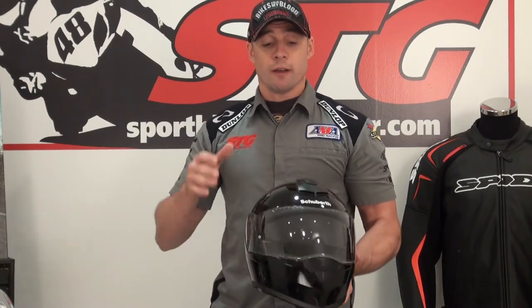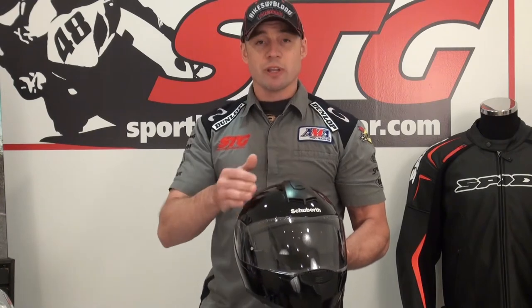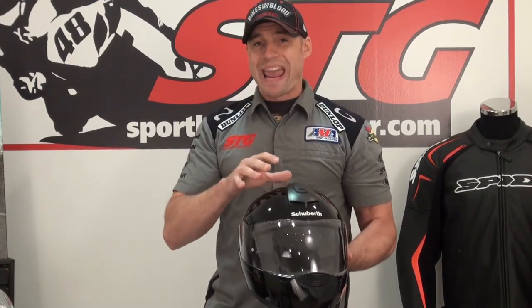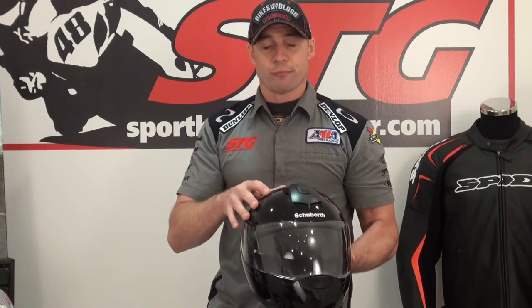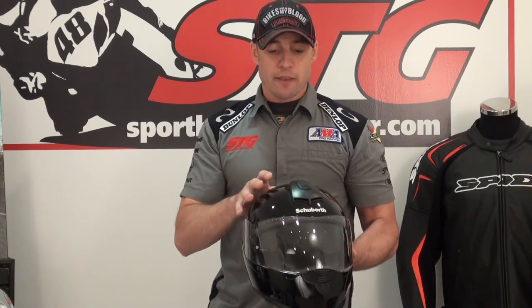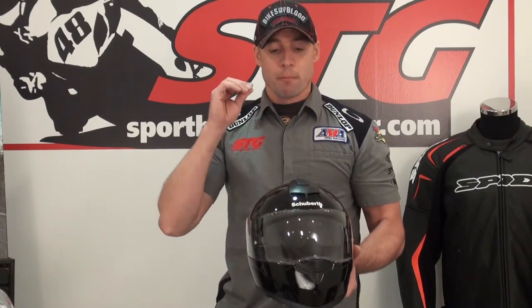You can have a look at some of the factory videos — it's crazy clean, and these people are working in white lab coats. The shell thickness on this is the most consistent in the industry. They have a proprietary, guarded technique to deliver extremely even shell thickness that allows the shell to be thinner because you don't end up with thick spots and thin spots. When you mold a shell largely by hand, it's nearly impossible to get it even. They've dialed it to the point where the fibers are cut in exact size pieces, and they use a proprietary molding process with compression and heat. Then they test it by setting it on top of a light bulb, and a Schuberth worker inspects the shell to make sure all the fibers are lined up in the right spots, thickness looks good, and even the overlap is proper.